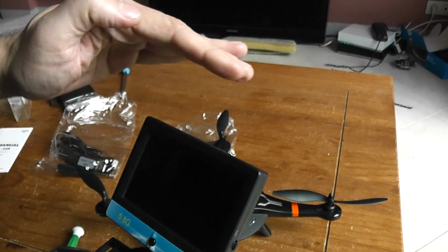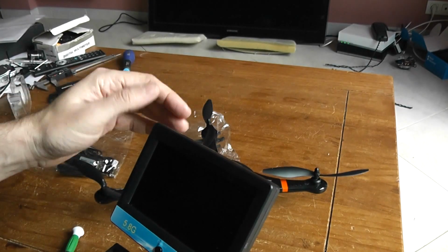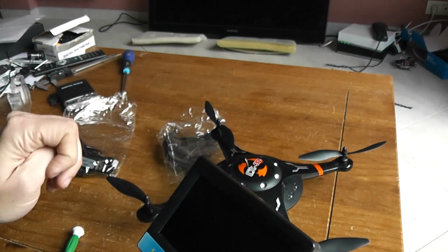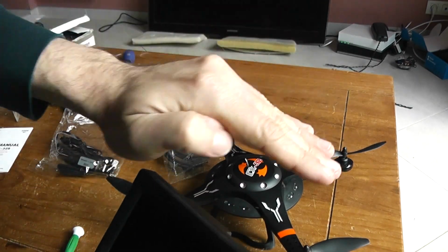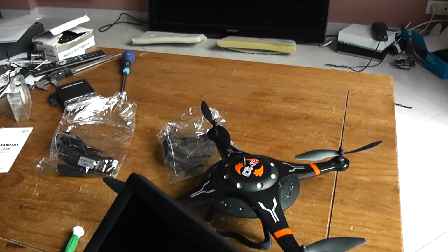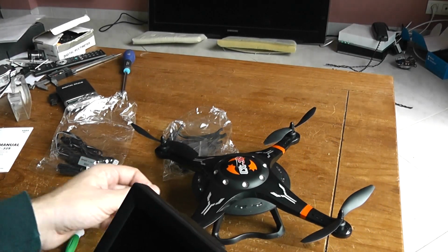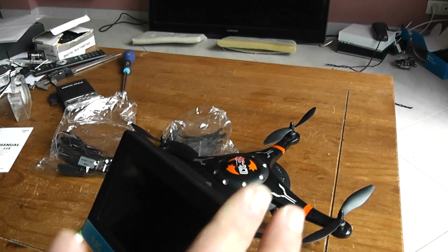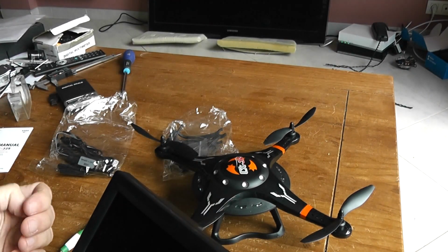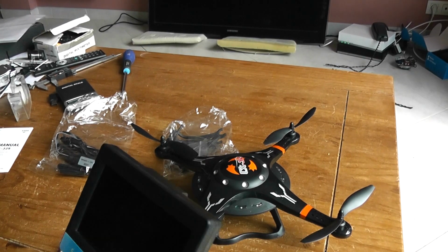It means that this antenna will favor the reception of more vertical signal coming from the upper part of the sky. So when you are at higher altitude, the reception will be good, but on the other hand, if you are farther away in horizontal distance, it will not be so efficient. So if you plan to fly this quadcopter in more low-riding flight, I strongly advise modifying your antenna positioning, and maybe why not install a small RP-SMA or SMA connector to install a cloverleaf antenna. It should be more adapted.